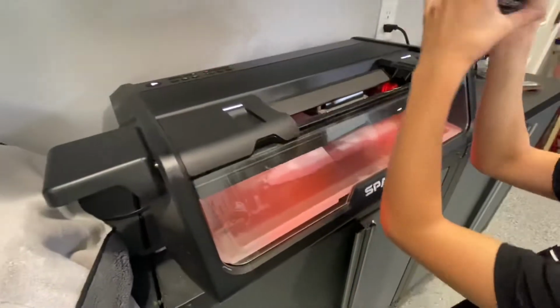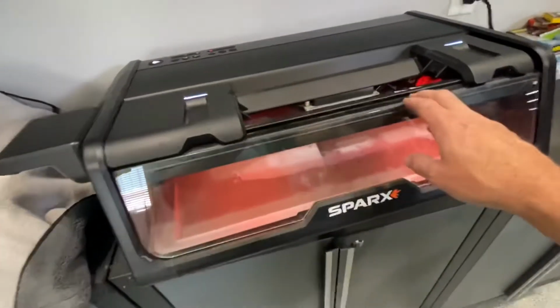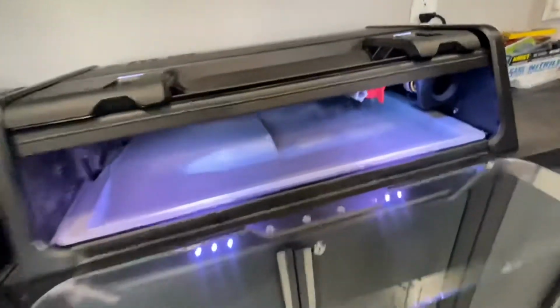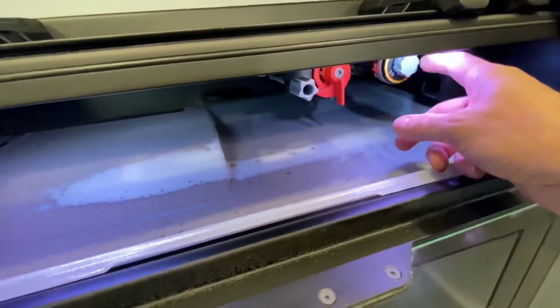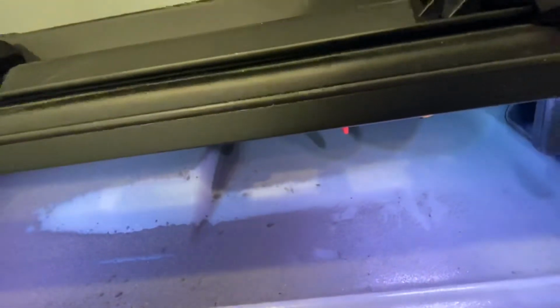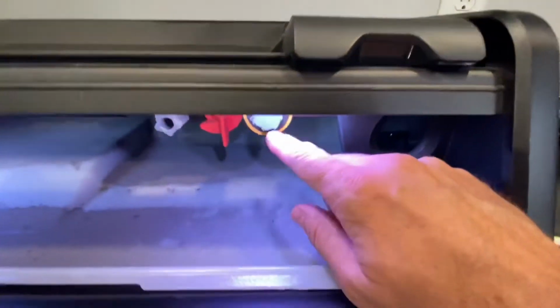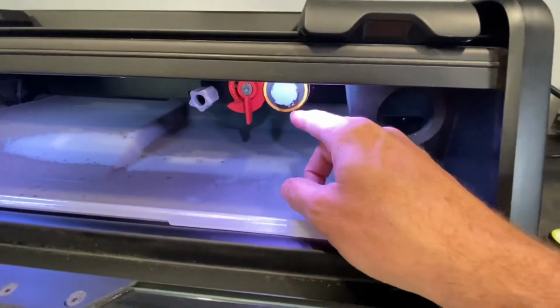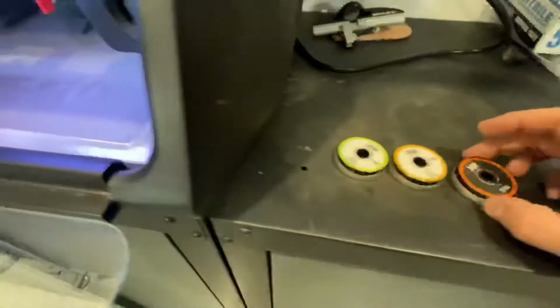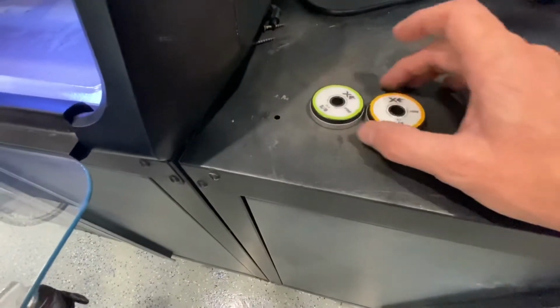One quick thing we'll just point out. We have this set up so if you open this up when it's open, this is how you change out the grinding wheel. So we have in here right now the half inch. This is half inch, a traditional radius. We have a 7/16 traditional radius, and then we have a half inch fire and 5/8 fire.